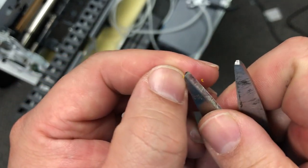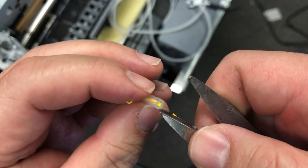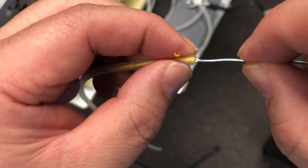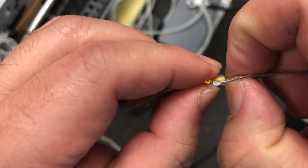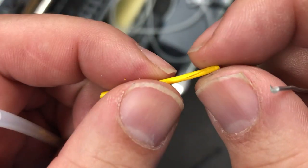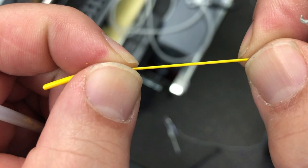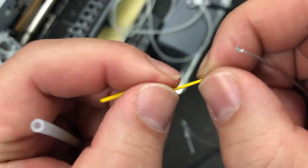You cannot dissolve it, and you cannot push it. Even if you have a steel rod and push from one side, it's rubber against rubber — there's no way you can push it out, no matter how hard you try. Let me take the clog out so you can see. I was able to just pull the whole thing out. See how soft it is — if you push it, it will just become larger and eventually you cannot push anymore. It's very elastic; I can stretch it really, really thin. So there's no point in unclogging this — you have to replace it.